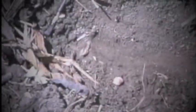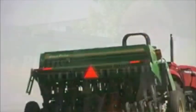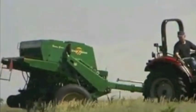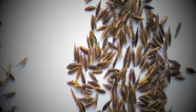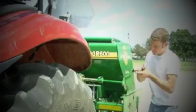Inspect your seed delivery hoses for clogging. If a majority of your mix is little bluestem and/or side oats grama, be sure to maintain a slow to moderate drilling speed. When drilling a mix of grasses and forbs where the seed has been conditioned, there is not a problem mixing the grass and forb seeds and drilling all through the same box. To compensate for any separation that might occur, only fill the box to two-thirds capacity.